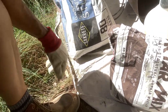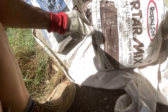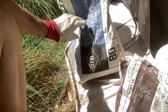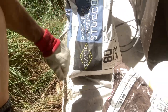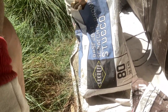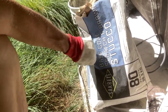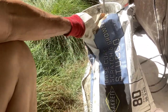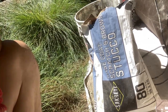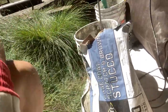Adding Rapid Set is going to make the material stronger, but not crazy strong — because if you ever try to cut through 100% Rapid Set in the future, it's like steel. It just doesn't cut easy. This recipe is what we always use on larger projects, only we buy it in bulk — the plastic cement separate, then mix with plaster sand. It's pretty much equivalent, but this pre-measured bag is ideal; we don't have to worry about too much or too little sand.